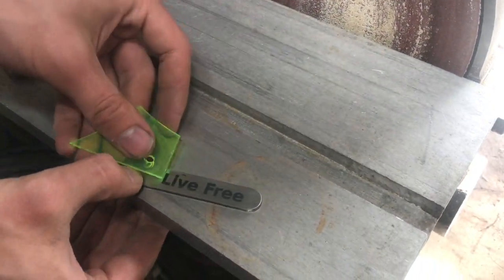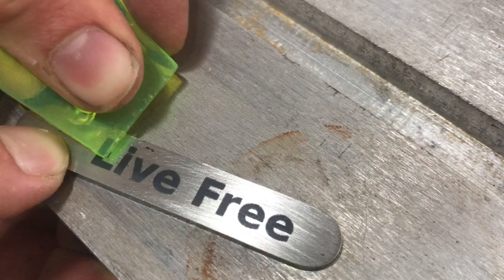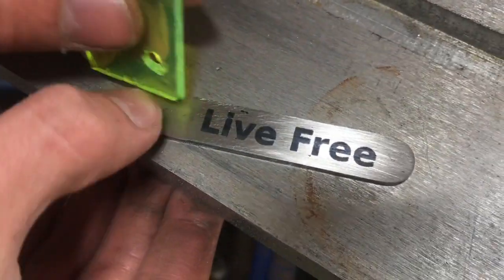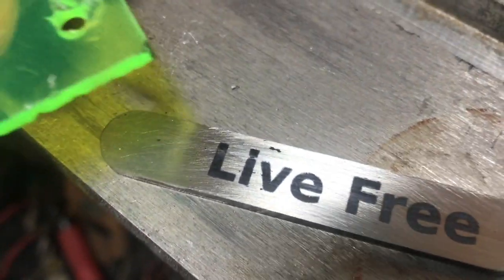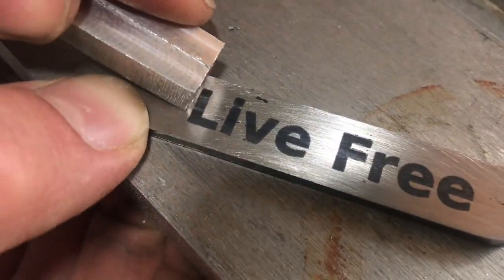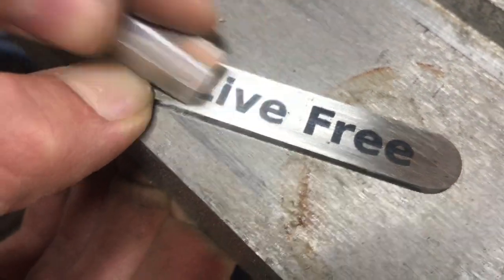This is just wood — very soft material at the bottom of the pyramid of hardness. Next up is a piece of acrylic. I'm pressing pretty hard. There is black on the acrylic, so I'd assume a little bit is coming off. If I really work on this L, I think I can get it to look a little lighter — so with acrylic it is coming off. I'm going to keep going up with hardness. This is aluminum — we'll see if I can slice right through it with a corner. It's still pretty tough though. Mild steel.